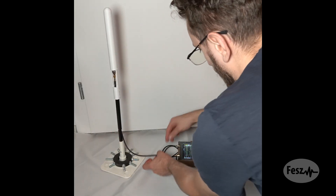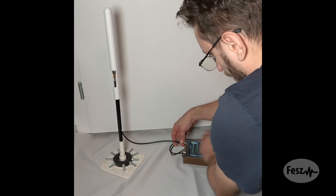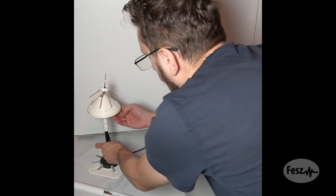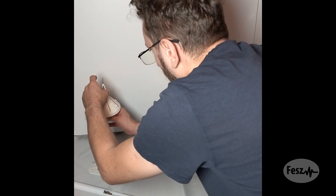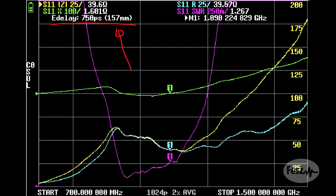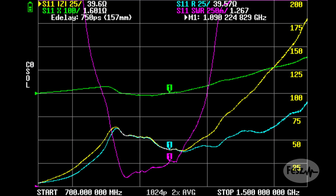Just to check the behavior, I first connected it to a VNA to verify the impedance and standing wave ratio. This seems to have a very decent and wideband SWR, about 100 to 200 megahertz — quite nice, especially when we compare it to a ground plane antenna. For the exact impedance measurements, I did add some electronic delay to compensate for the connector to feed point transmission line length, though I'm not really convinced of the exact accuracy. It does seem to be relatively close to 50 ohms, though slightly lower.